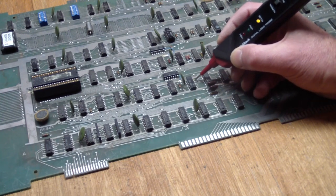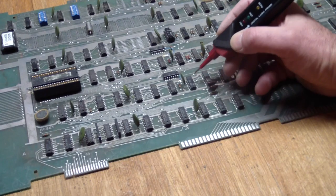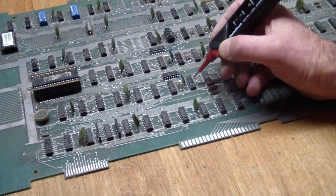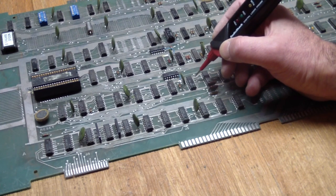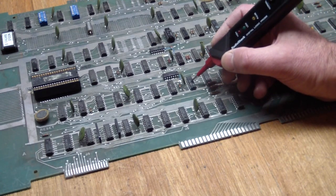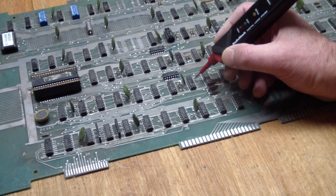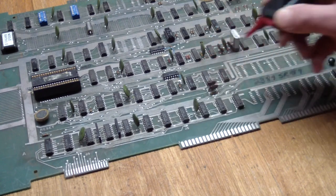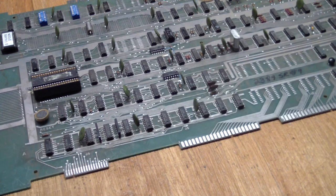Q-bar also feeds back to the data line on the flip-flop to create the divide-by-2 effect. The gut feel is to rip this chip out and put a new one in, but we should first figure out: is it really this chip that's bad, or is something down the line loading it down? It also helps to look on the scope and see what these signals look like.